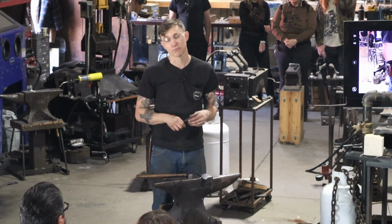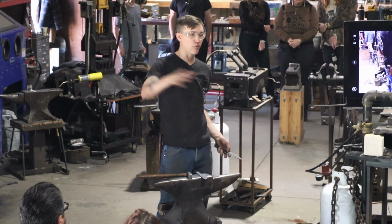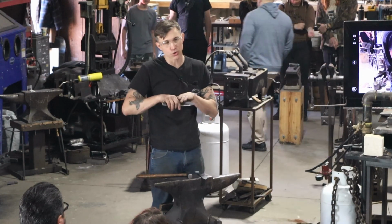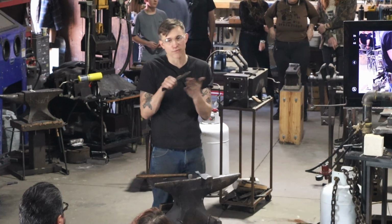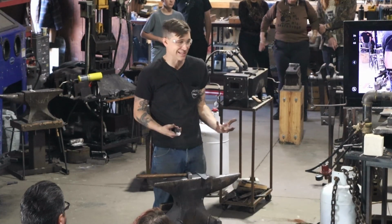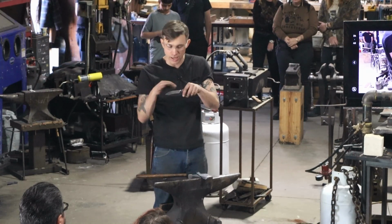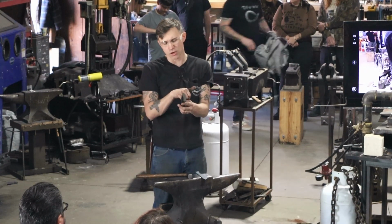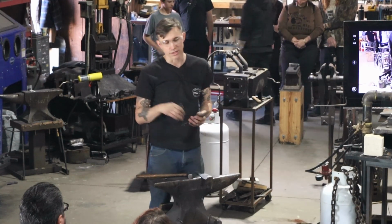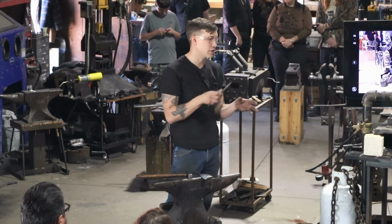I'm going to get that thing pretty close to the shape that I want it because everything over your coarsest belt is surface conditioning. Even if it's a 60, you're just going to gradually fine tune. And another thing I've learned from batch grinding is I don't make them all super perfect. I get all the meat and I get the thickness established, but I'm like, oh, this plunge is a little different than that one. Grind, throw it off the side, grind, throw it off the side. And then as I go 60, those are going to get a little better. 120, those are going to get a little better too.